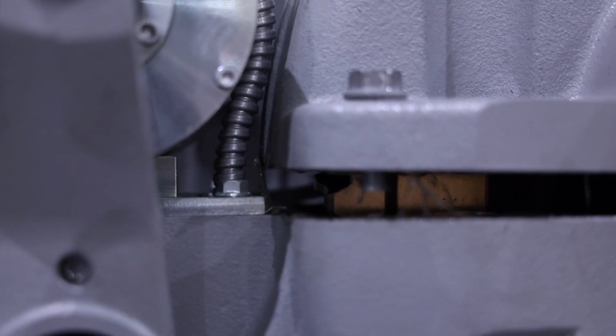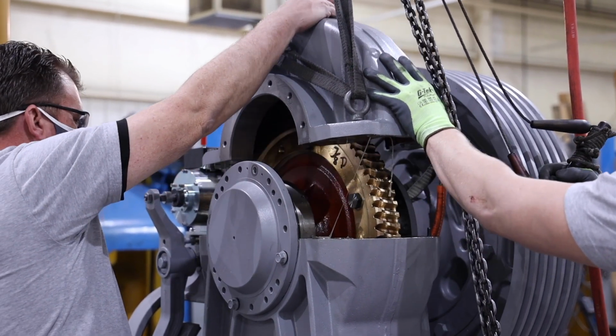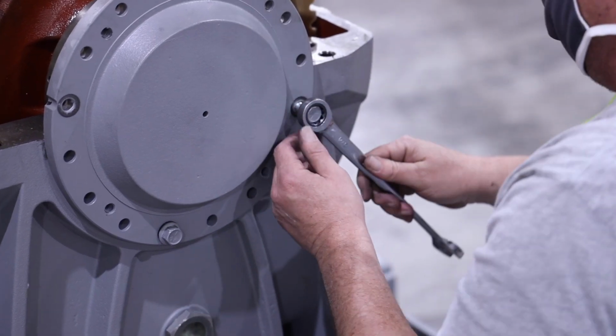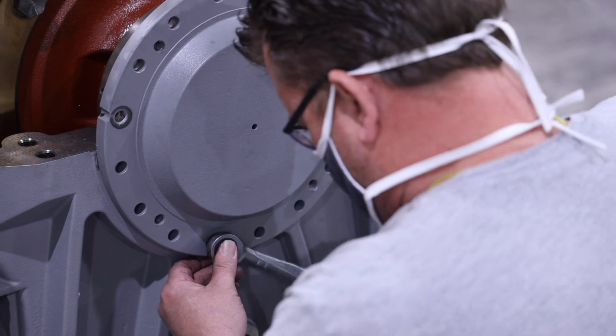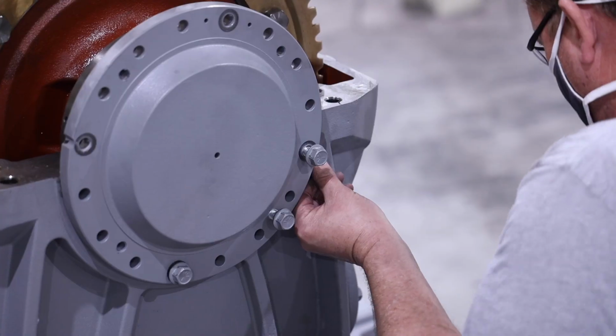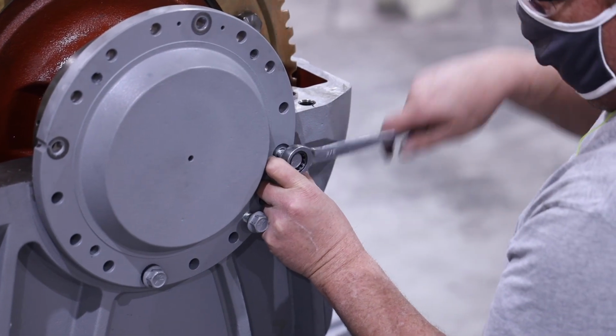Before proceeding with removing the center assembly, ensure that it's adequately and safely supported prior to removing the hardware. With the eccentric still slightly moved away from the housing, rotate the shims out on the lower bolts that secure the outside eccentric to the lower housing so they can be seen. While holding the shims, remove the 2 lower bolts on the outside eccentric.